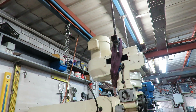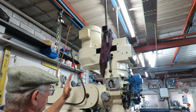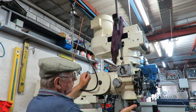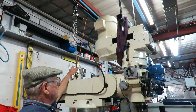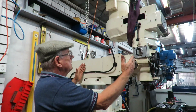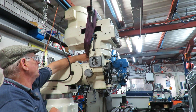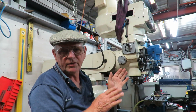Originally I planned to lift it through here, but this is aluminium casting, and I was concerned that the max weight we've got here would be a problem. So that's bolted through, and that's the primary lifting — through that shaft — and then the auxiliary at the back here, just for balance, because most of the weight is in this area. I'll put a sling here just as a precaution in case that bolt breaks, but I don't believe that will happen.